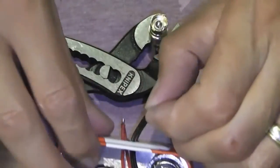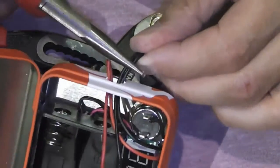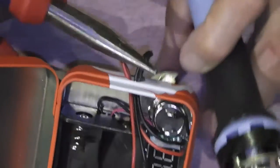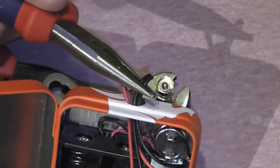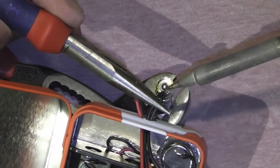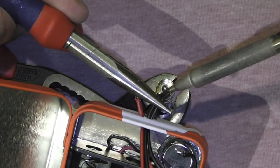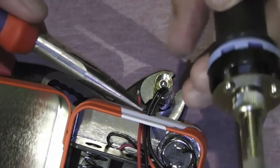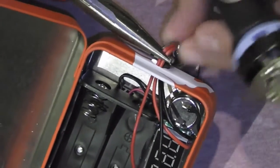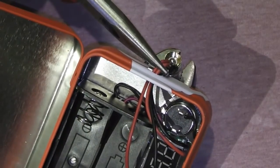And hopefully, there's been a few people that have actually asked me how you finish off a tin and how you get the outy connections in and all that sort of stuff. I always use a pair of grips for this. It makes it so much easier, so much more stable. Solder it down and get your positive, and solder that down on the outy connection.